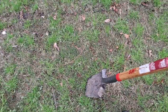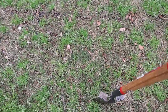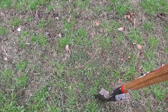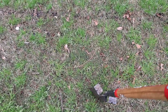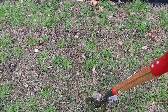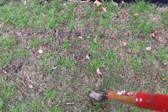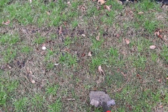It will be either very difficult or impossible to trench depending on your grass or dirt, because some areas I have trenched in the dirt is super hard and rocky and it is very hard anyways, even with this shovel. So don't make it any harder than it has to be. You're going to have to dig in the ground about six inches, and since we're going to be doing a line like this to put the wire in, you're going to have to be doing a lot of digging. So I'm going to give you an example of what it looks like.